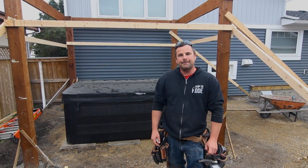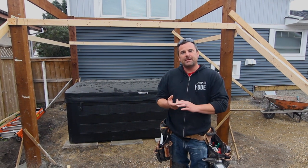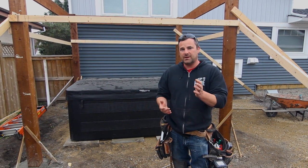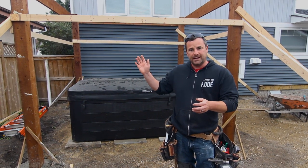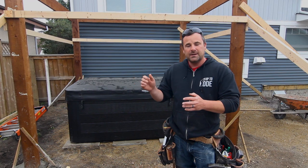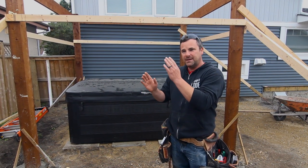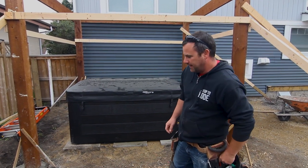We're back at it — we're just going to joist this thing out. This tip I'm going to give you right now is super handy for figuring out your spindle spacings, whether that's an interior railing, a deck railing, or a pergola just like this. Normally when you're doing a stud layout, it's just 16 centers. But in this scenario, I want all the joists to be exactly the same distance apart, so I'm going to show you the math on that.